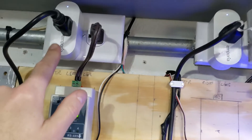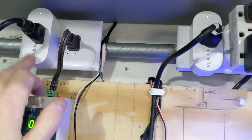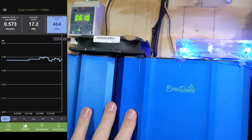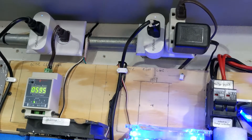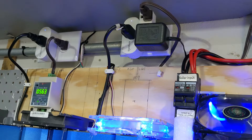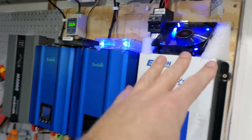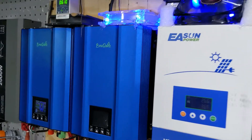They also come with that meter over there. They have their own separate lines coming through this conduit — I had the conduit for free and installed these lines myself. I bought two Emporia meters at $12 each; they tell me how much power is going through each inverter throughout the day so I can track how much power I produced. They also allow me to turn on and off my inverters from my phone in case of emergency, and you can schedule certain things. I've added three coolers on top to force air behind the passive cooling and keep them a lot cooler.